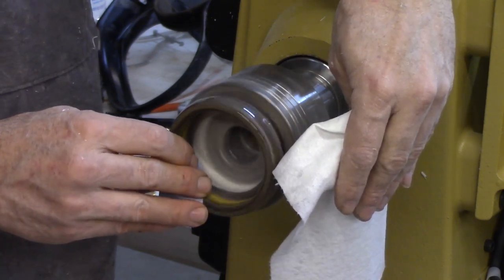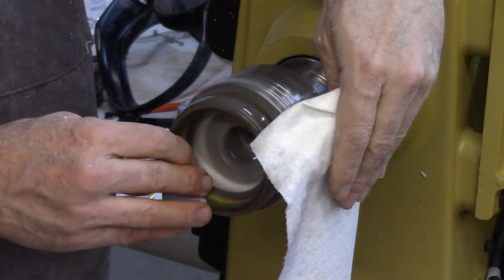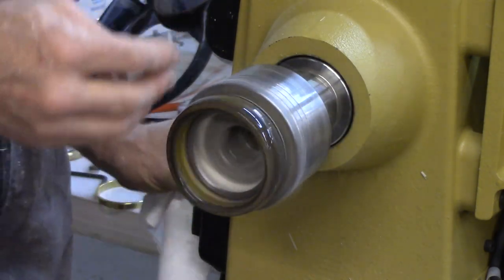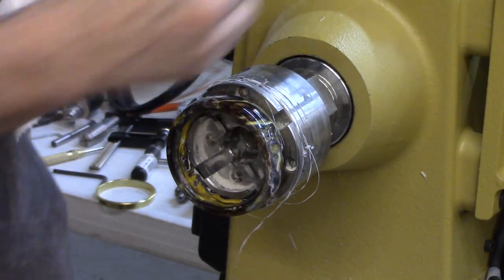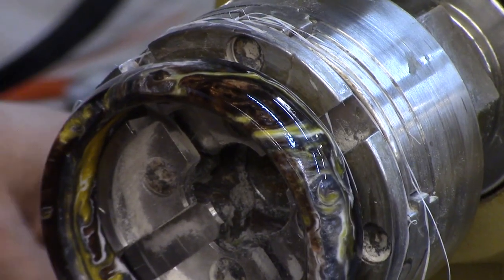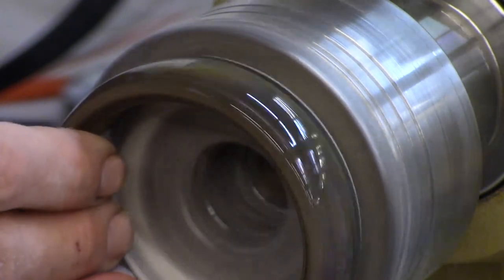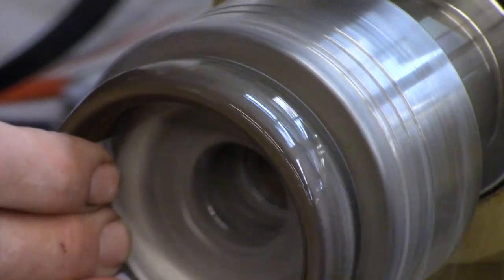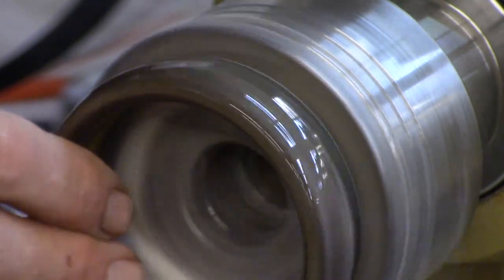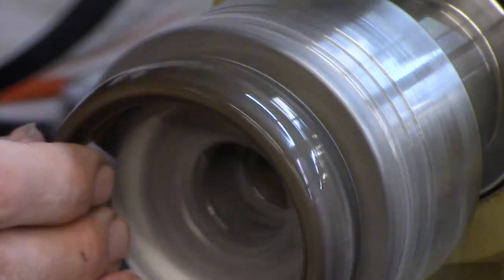It does. And I can tell you that anything bigger than pins, especially when I'm doing translucent blanks like the dragon eggs where you can see in them, I do each grit like I'm doing right here, and then I stop the lathe and I sand parallel with the lathe bed by hand. That becomes important with translucent colored blanks if you want that clarity. Because that's the only way you can tell from one grit to the next when you've got all your sanding lines out. It's easy on a bigger turning to get too fast with one, and not get the lines out from the previous one.